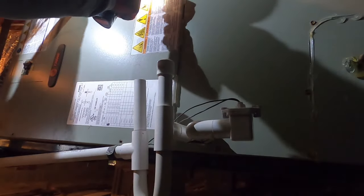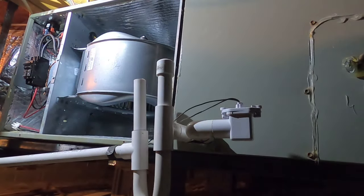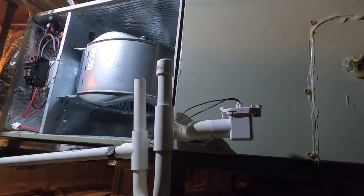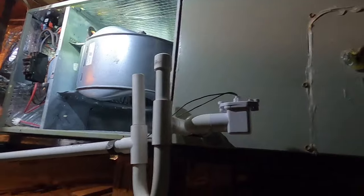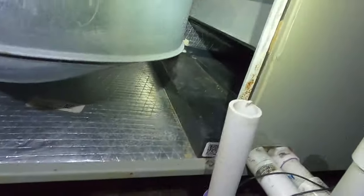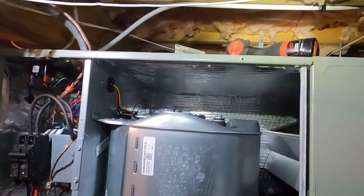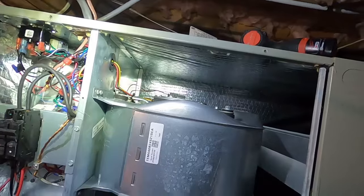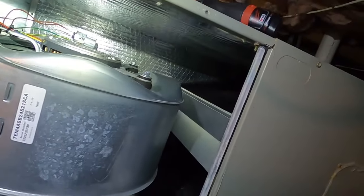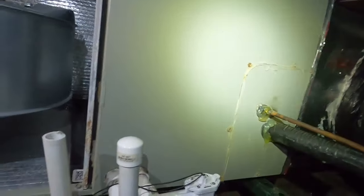We also put a coated coil in this thing last year. Everybody knows anything about dirty sock — I'm not an expert on it — but there was a manufacturer who had legal issues with it, a class action type situation back in the early 2000s, and that manufacturer won. Basically it comes down to chemical makeups inside the house: furniture, carpet, paint, cleaning chemicals, upholstery — all those things off-gas at certain temperatures and humidities, and with the right combination they collect on the coil.